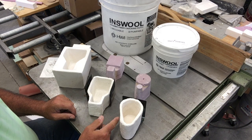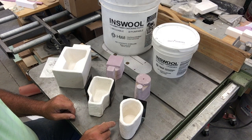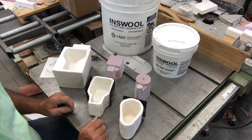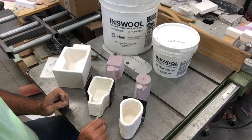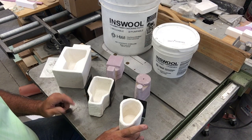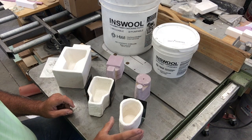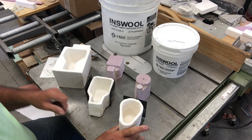You don't have to dry it out — you can fire it wet. So if you want to patch something you can put it in there and fire it. I fire them at 1800°F because that's what I've got my resistive electric furnace set to; there's nothing magic about that temperature. The material has a service temperature up to 2300°F and it's popular in the foundry industry for troughs, sealing gaskets, and crack repair.